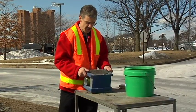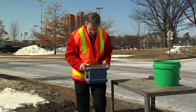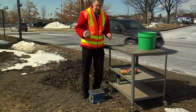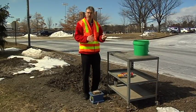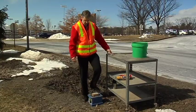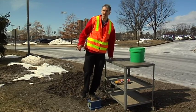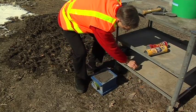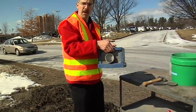That's all there is to it. This will now support my weight, and you can see it's nice and round. I'm going to put a piece of wood — the main reason is I don't want to point-load it. Normally we want a foot of cover over any pipe under a roadway because of the weight of a truck; in this case we've only got an inch or two. And as you can see, it supports my weight just fine — no issues at all. It supports my weight and the pipe is still nice and round. Thank you very much.